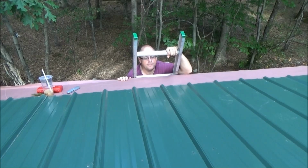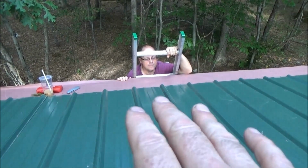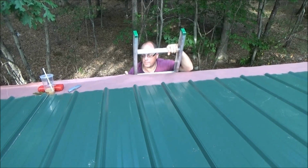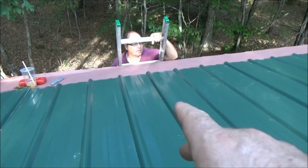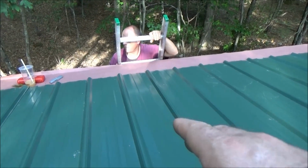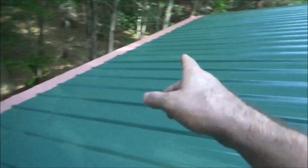Yeah. All right. The drip edge will go on first, and then the metal will go over that. Right. And then that'll go on to the rain gutters. And you got your rosin paper, so that the metal doesn't stick to the tar paper as it heats and expands and contracts. So we did that according to the manufacturer's recommendations. There's rosin paper underneath the whole entire roof here.